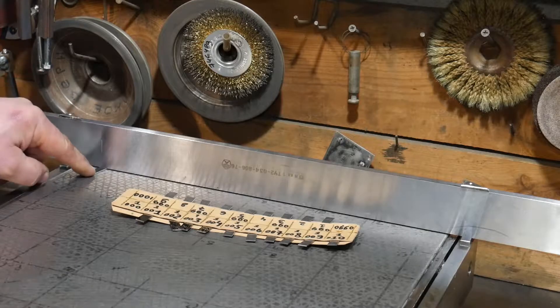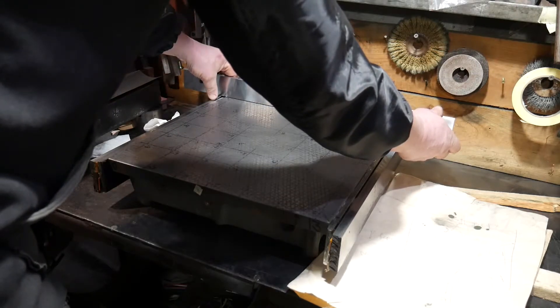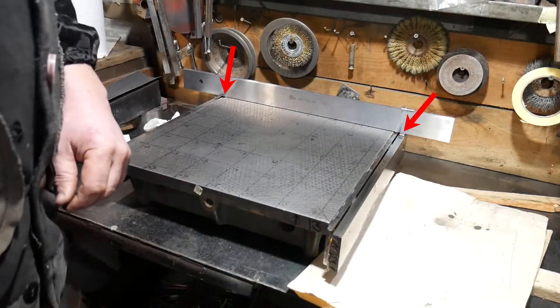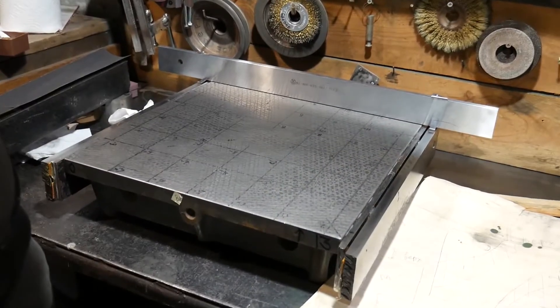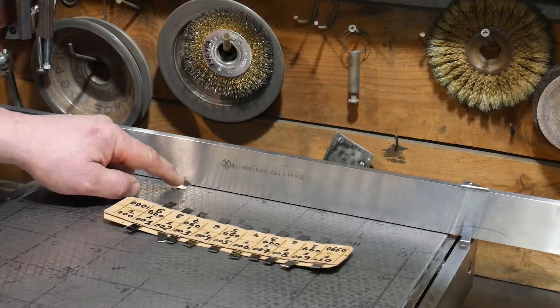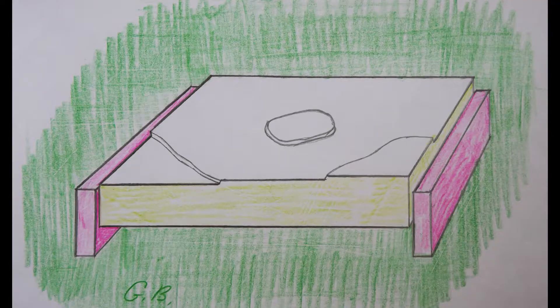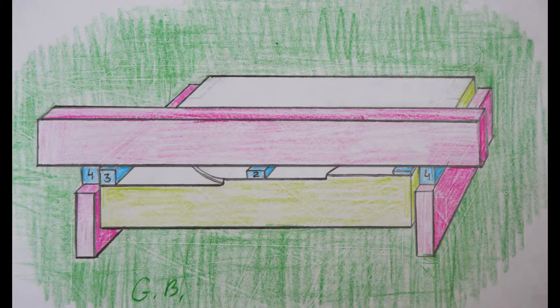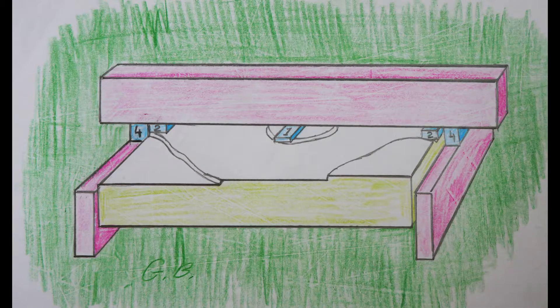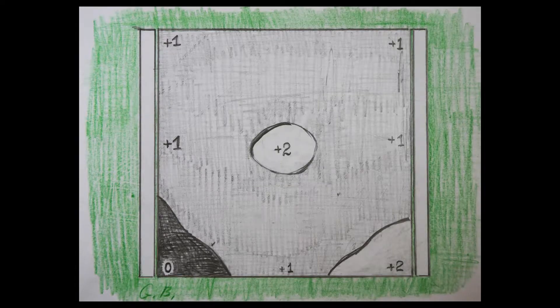In leveling this slab, the scanning had to be done 17 times. The straight edge is mounted on side rails resting on two measuring blocks of the same height. Scanning is performed by measuring the gap between the straight edge and the slab using gauge blocks. I select suitable calibration blocks according to the size of the gap, move the straight edge according to the measurement scheme, and as a result I get a surface scan.